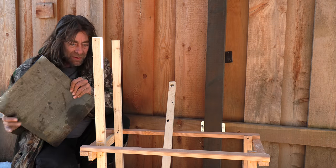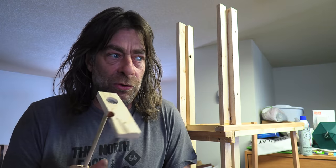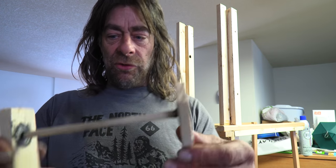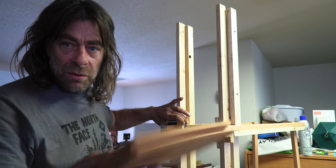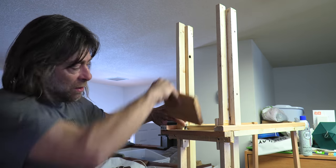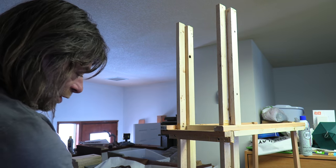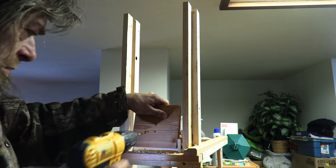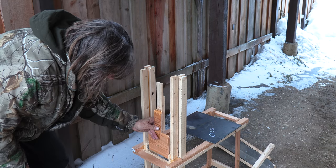I've got my plate steel which is going to slide between the two — down she comes. I'm working on the trigger system for the guillotine, and it's probably the hardest part of the trap so far. I utilized the ends where my bearings were, glued a dowel in between and it spins quite nice. There's a groove in the dowel, and when the fish comes through it will push easily because of the bearings. The spool will sit here with the line going through the trigger system. The plate of metal will sit here and should push right out.